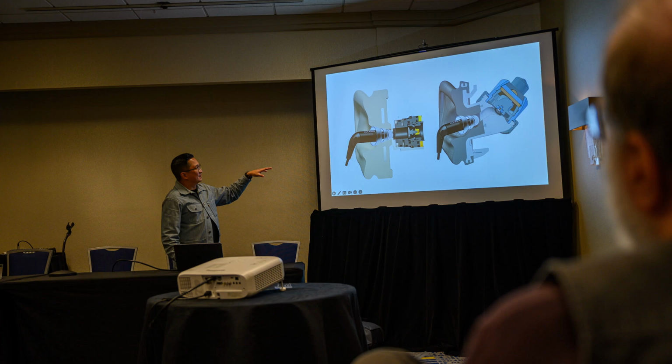Check this out, man. They set this thing up. They modeled this. That's residual or remaining volume ahead of an ER4XR: 575 cubic millimeters ahead of the tip on a 711, 750 in front of the ER4XR in 5128 or 4620. So a receiver radiating into a small enclosure will generate a sound pressure inversely proportional to the volume of the space. Less space in a 711, more pressure.